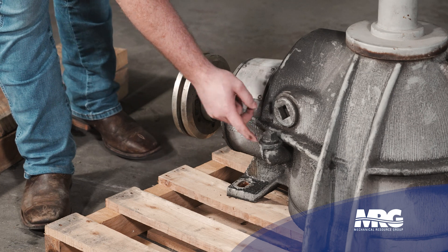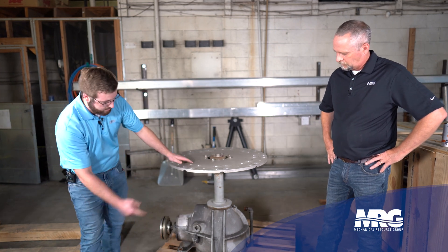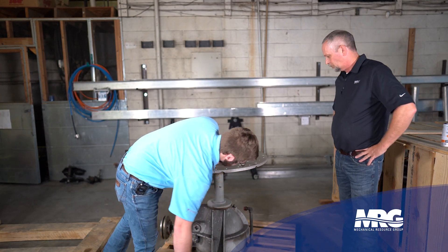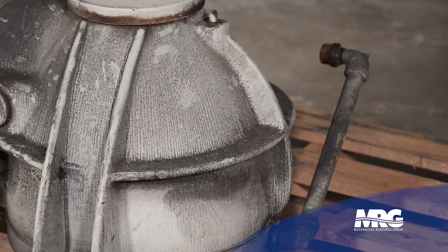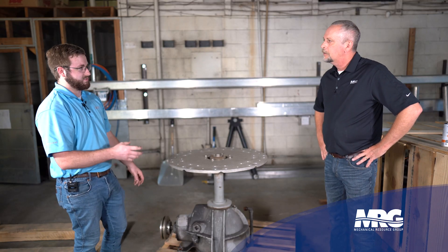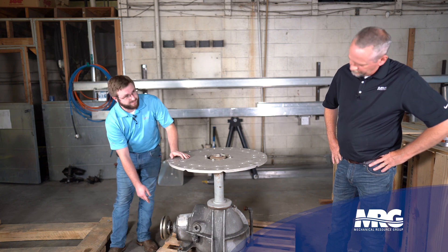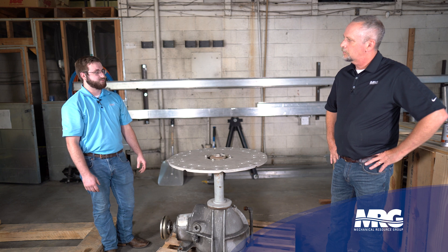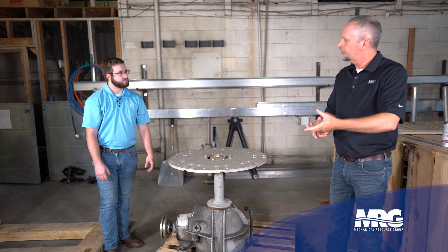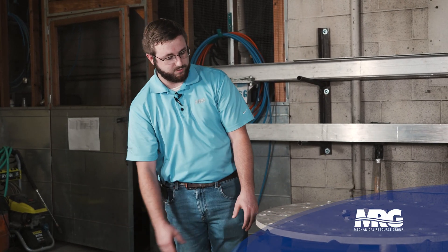This is your fill plug — you'd either have a tube connected to it or a cap like this one has. On the side you have your drain plug, where you drain the oil out; it should lay flat so you can safely drain into a bucket without making a mess inside the cooling tower. Also check your coupling — it's a rubber coupling, most look like a donut. Inspect it; make sure it's not cracked and not wearing. Typically in a cooling tower, the motor sits right here connected to this gearbox.